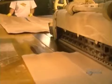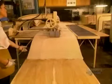To make veneer sheets for the front of the plywood door facing, the side that will show, they line up the wood's grain and other features in mirror image. For the back, the side that won't show, they assemble the defective parts they cut out earlier. They use 3 veneer sheets to make up the plywood door facing.